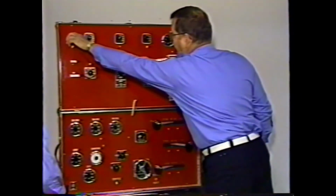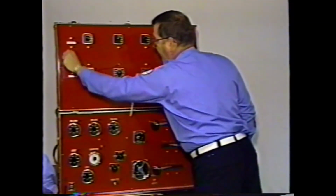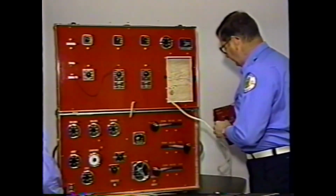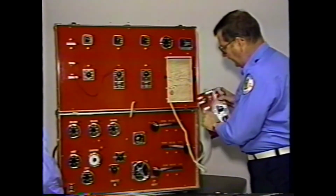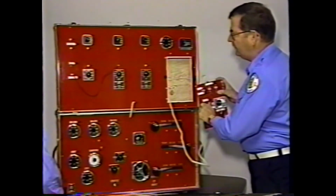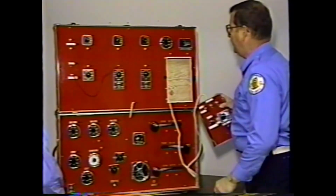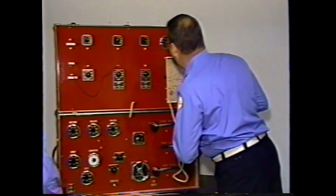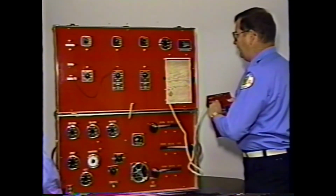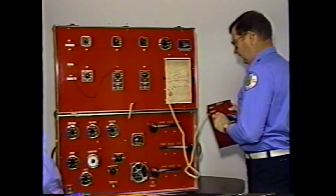In addition to an elevation problem, we can also hook into a standpipe or relay problem. On a standpipe problem, we plug in from a hose right into a standpipe. The instructor is then able to change the amount of water taken by a standpipe by controlling this discharge switch. This changes the amount of water being taken by the standpipe or the relay. I will now hook the pitot gauge into the standpipe setup. I will have the discharge line fully open, and you'll see as I vary the amount of water taken, the various pressures going into the standpipe will vary considerably.